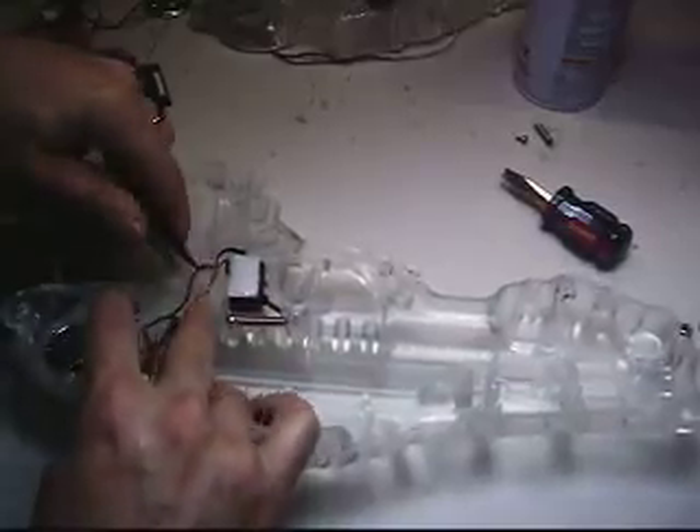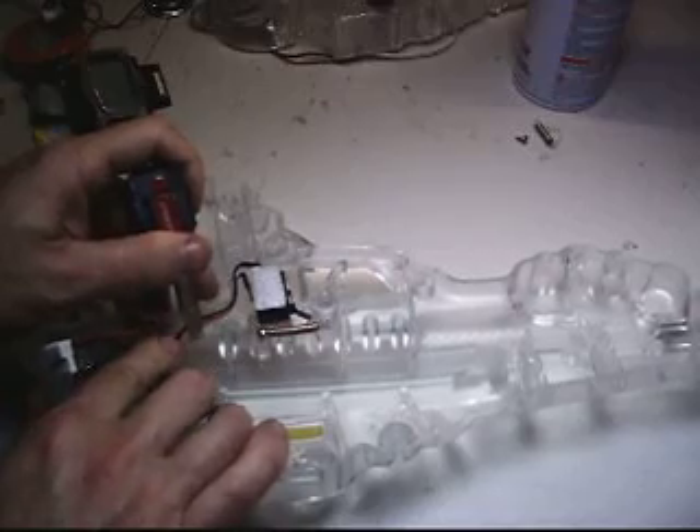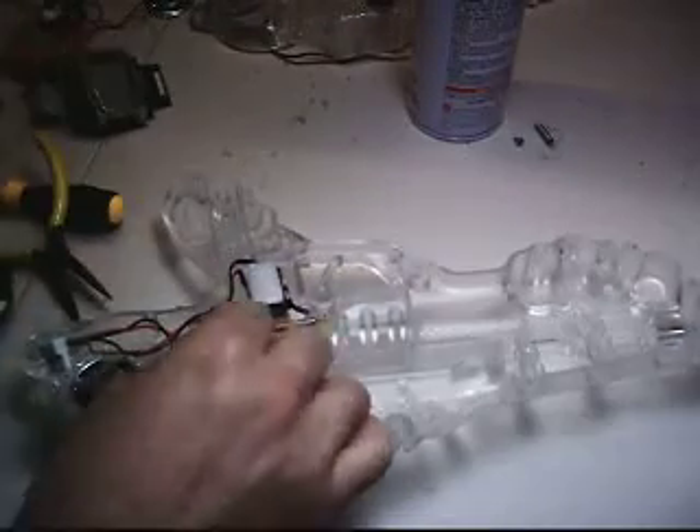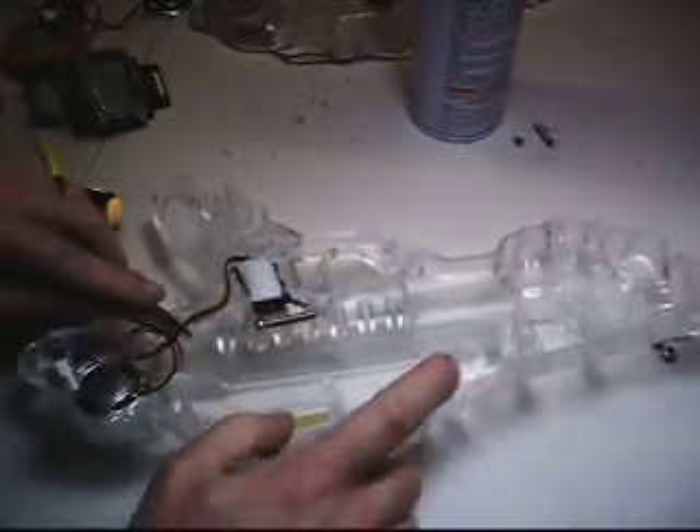Time to put in the main PCB. I like the way they ran these wires — I'm going to take this out myself. I like them to come right around that side wall, just like that. Some hot glue here, then screwdriver and just press it flat. Hit it with some air in a can to speed things up. A little high on this side — I don't want the housing to stick together, so trim it off.